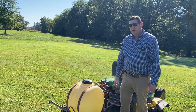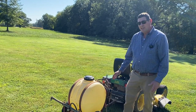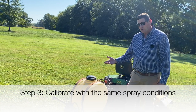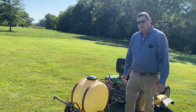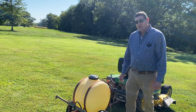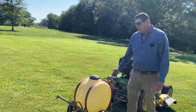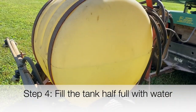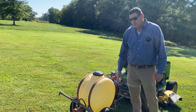We've measured our distance. A couple more things to get ready: we want to make sure that when we calibrate our boom sprayer, we're in the same conditions we'll actually be spraying in. In this instance, we're spraying on a home lawn, so that's the site we're going to calibrate on. I've already measured my 204-foot distance, and I'm going to fill the tank half full with water only, because I'm going to do another step to demonstrate the ounce method.